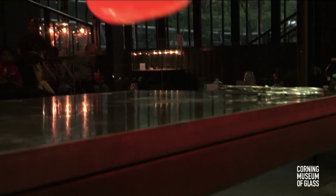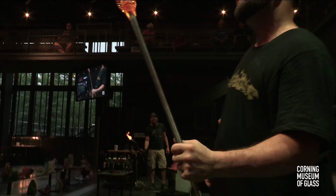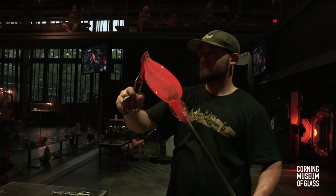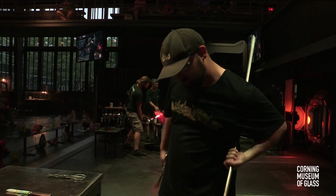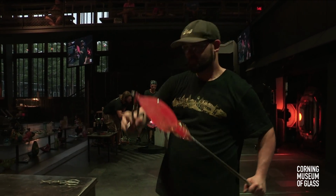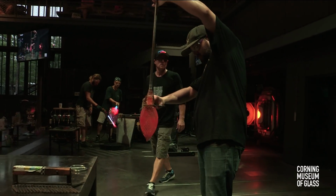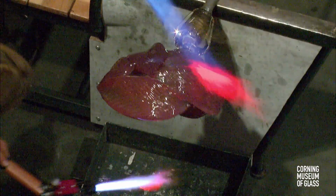What do we use to heat the ovens? This shop is run on natural gas. There are a few different ways to heat a shop. You can use propane. Some people are using methane. There's a lot of places that are capping landfills and then using the methane created from that to run a studio. But I've heard the problem is that it just doesn't create enough methane at a time to maintain a constant pressure to run anything this big. So you might be able to run a small furnace and maybe one or two reheating chambers.